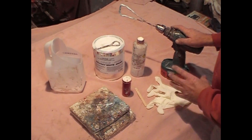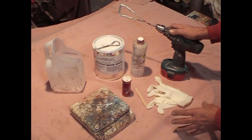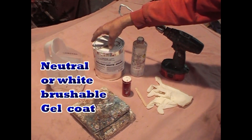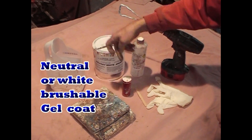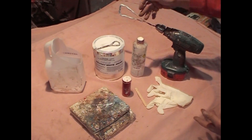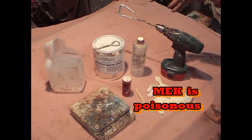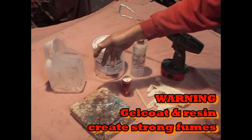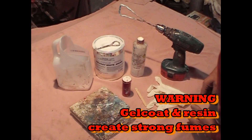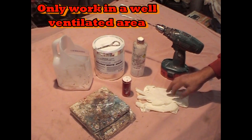My die's ready and my cloth's all cut. These are the tools I'll need to actually start laying up the fiberglass. First step is gel coat. I've got some brushable gel coat which comes in either white or neutral, to which you can add colour. The catalyst is MEK — very dangerous stuff, be careful with that. A cordless drill with a wire whisk for mixing, a milk bottle cut out, and a set of kitchen scales. If you don't put them in a plastic bag, that's what happens to them. Paddle pop stick and lots of disposable gloves.